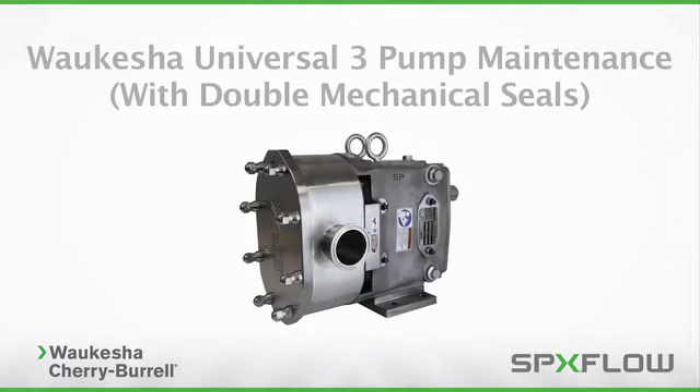It is important to note the use of a food-grade lubricant in the maintenance procedure to ensure proper operation of the pump and its internal components. Use of other types of lubricant may cause damage to internal components, resulting in a malfunctioning pump. Please refer to the operation manual for additional details on where and how to apply lubricant throughout the maintenance process.